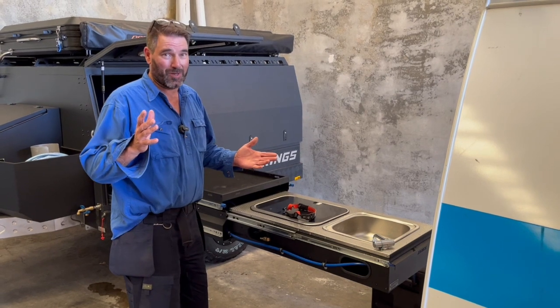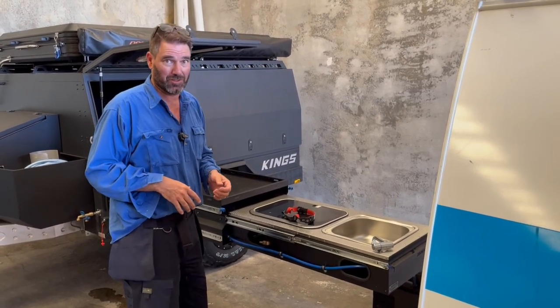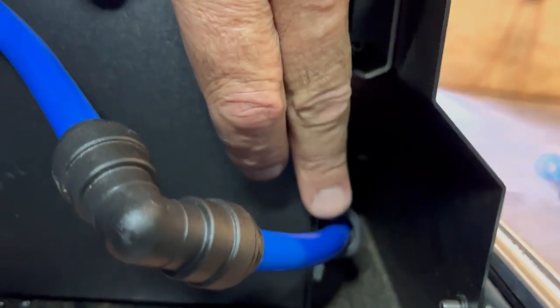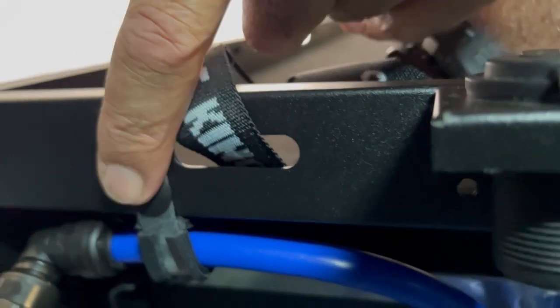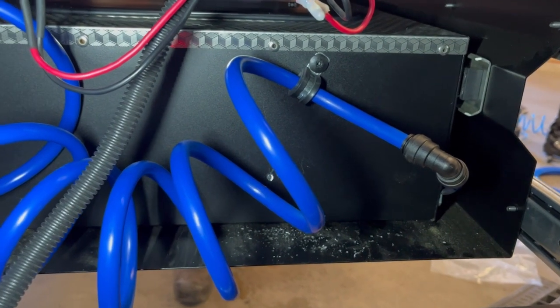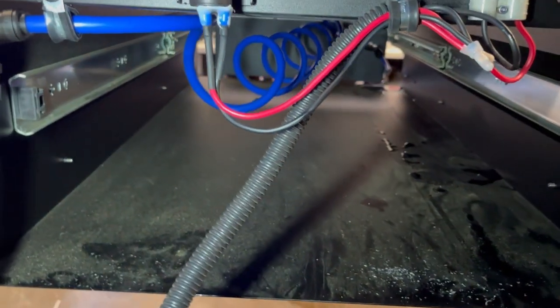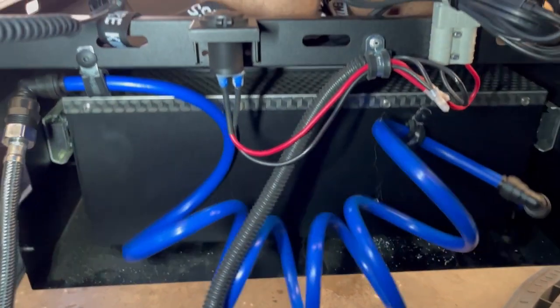So it seems to be working all right. I'll show you what it looks like when it's slid in and when it's slid out from the inside, so you can get some ideas — you can do this yourself. I reckon this is a good solution if you guys are out there with these King's Campers — sort it out, you don't have to worry about it anymore. Okay, here's that pipe that goes down the side of the kitchen. It's got the elbow on to give you a bit of flexibility. And I've put the clip up quite high on the back of the kitchen here. You can see the spring just goes all the way. And then I've got another clip that's clipped to the back of the fridge drawer here, and that holds the elbow with the stem — so that's got a lot of movement as well. That's fine for a John Guest fitting. And that just lays down on there. So as it pulls out — okay just pull it out, Joshy — it comes out and just sort of goes in there. And that's where it's full. So it stays there quite nicely — it's pretty good. That clip's nice and high. It just lays it off, and when you push it closed again, it all just sort of bunches up like that.